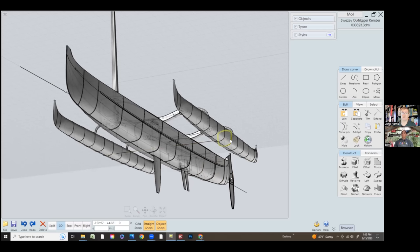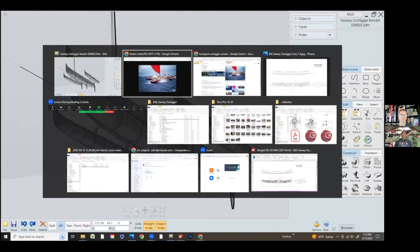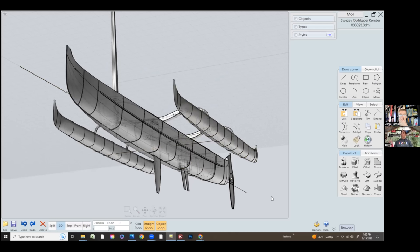In the niche of canoes, kayaks, and small sailboats, it's pretty rare to have anything with the kind of speed potential where having very full ends is an advantage. This one is kind of great because you're so skinny that you get the best of both worlds. If we were going to be paddling all the time or 50% of the time, we probably would have made the boat a little more delicate underwater. No boat is perfect — everything is a compromise. But I felt like with really narrow hulls and a light boat, you could get a really nice balance between sailability and paddling performance.